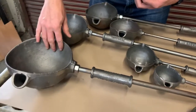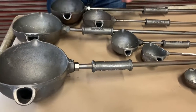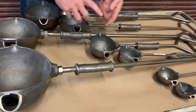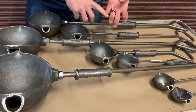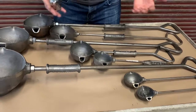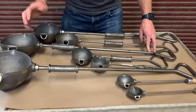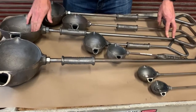These are designed for scooping out of molten metal — you do not want to be melting metals in these with flame underneath, it will not work. They're good up to about a thousand degrees, so really good for leads, pewters, zinc, Zamak, and similar metals in the 400 to 900 degree range. This will be one of your best ways to keep the dross back and get a nice clean pour and casting.